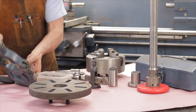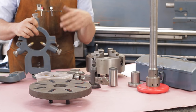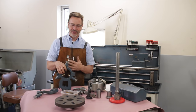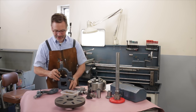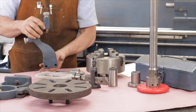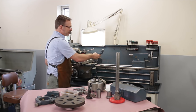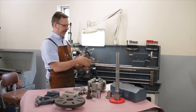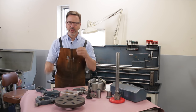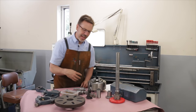Here's another benefit: a steady rest. This one runs on brass — not my favorite; I'd rather have bearings. It also doesn't run a very large diameter, which is a drawback of this lathe's design. Another great piece of tooling is a follow rest, which attaches right onto your carriage and helps you stabilize smaller pieces. There's also a face plate that came with this lathe.